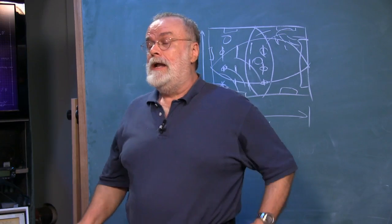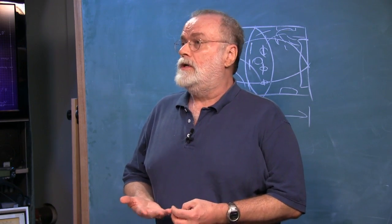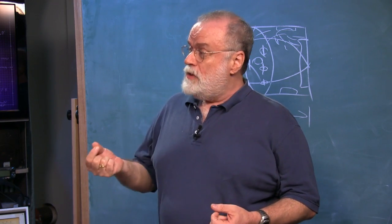Yeah, so these AVRs these days, a lot of the higher-end ones come with microphones at this point. Yes. Now this is something people should be using, right? It's to help calibrate their AVRs and have the real audio sound, because there are also delays going on when it comes to the audio reaching your ears at the different points, right? Right, exactly right. And so most AV receivers today have what's called auto calibration or auto room correction. And so they come with a microphone, as you say.